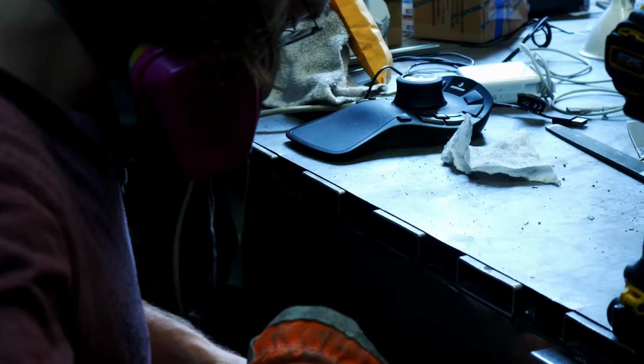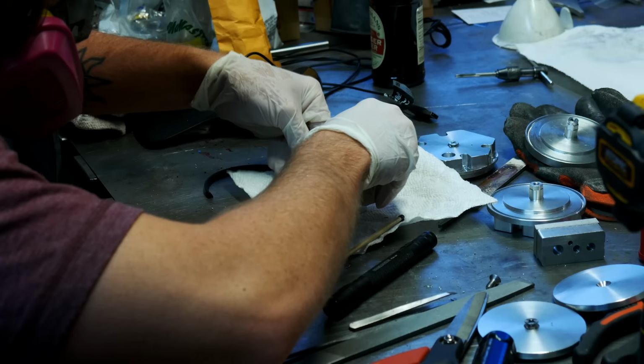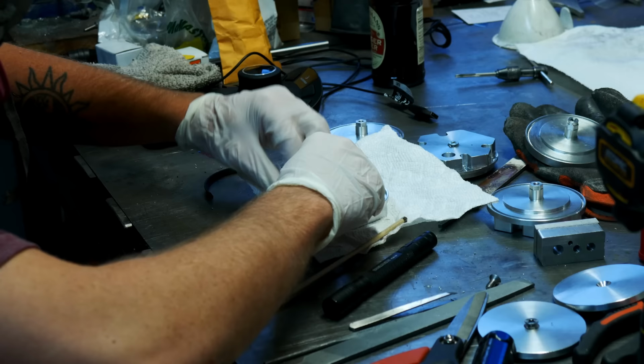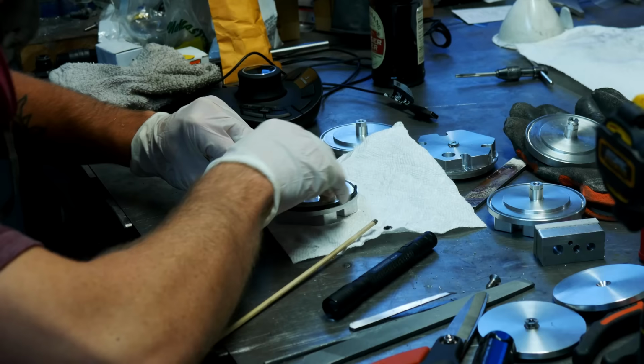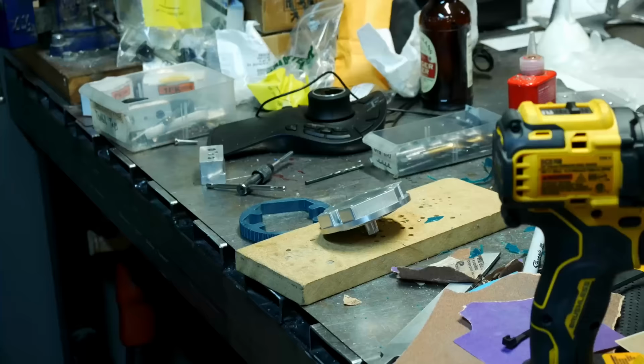There's the front side of that, and as you can see, there's a bunch of mounting holes for pins, and a bunch of threaded holes to mount. Here I am adding, this is a new thing I've done on this particular project, a washer or wiper to keep chips out of the bearing, and I 3D printed those on my resin printer out of some flexible resin, and they actually worked pretty well. I was pretty happy with that. And I cut in that small groove earlier, which you saw, using the UV light to cure them together. And the reason for that is I couldn't print the full thing on my machine.